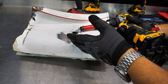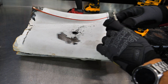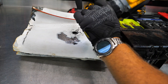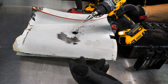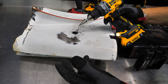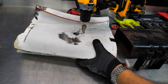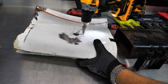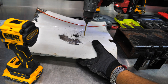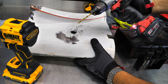Drilling holes with a twist drill bit or hole saw in sheet metal — not a big deal. If you're drilling just a hole or two with a twist drill bit, lubrication is optional. Now if we throw on a step bit — electricians like these but they're increasingly used in shops. They're great for drilling through firewalls, installing stereos, or fabrication work. The variability to drill whatever size hole you need is great. It works better if you drill a pilot hole first because the tip isn't as quick as a standard drill bit. Note that this particular drill bit is clearly dull.